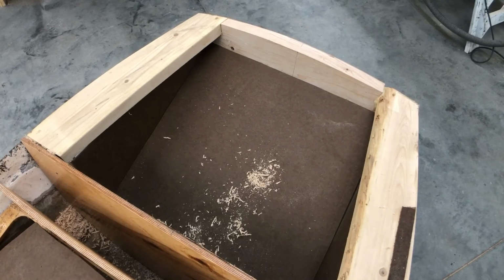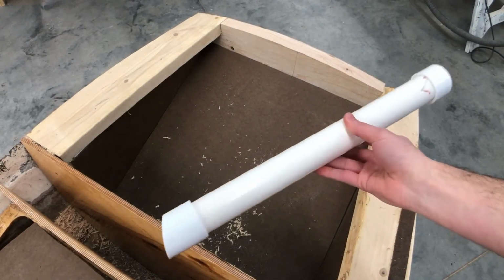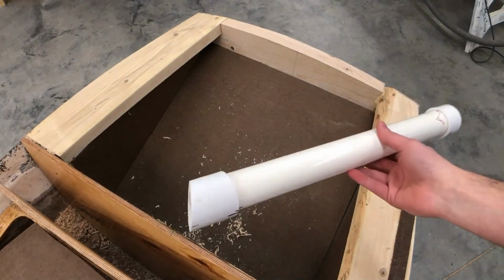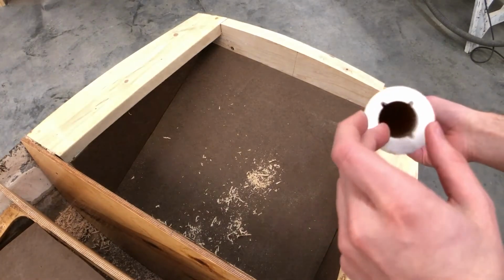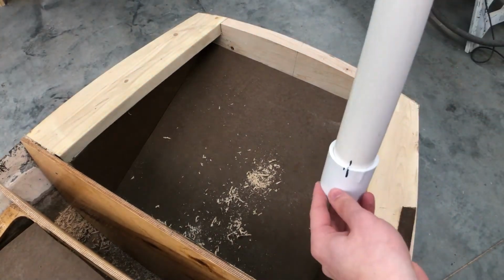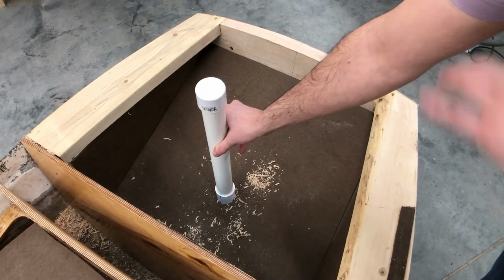So just to walk through some of the major considerations about this portion, because there's a lot going on here. It's these supports that are going from a place that's supposed to be dry into open to below, in a place that's going to be wet. So what we have is a solid trolling motor support, and here is what we've framed up. It's a specially designed collar with a specially designed filler that'll allow the trolling motor that we have to slip into it. And this portion gets sealed through the hole in the boat and completely gets watertight.